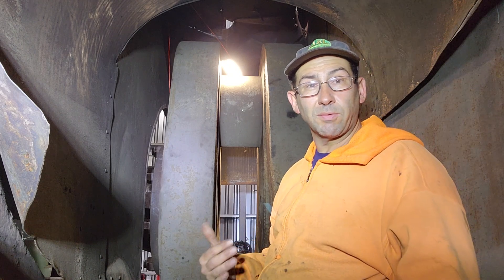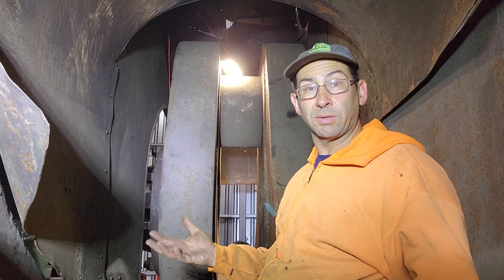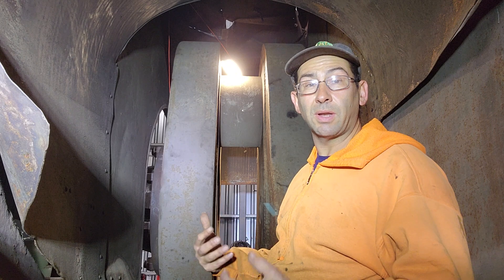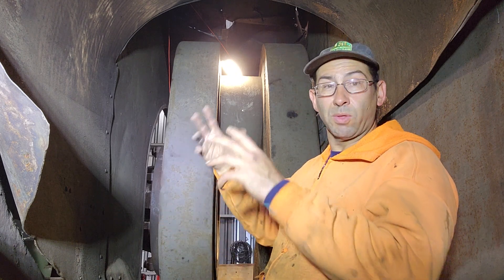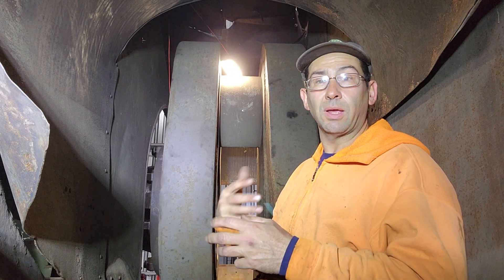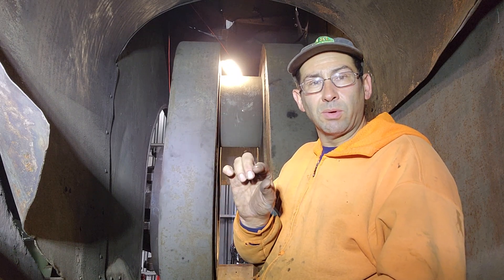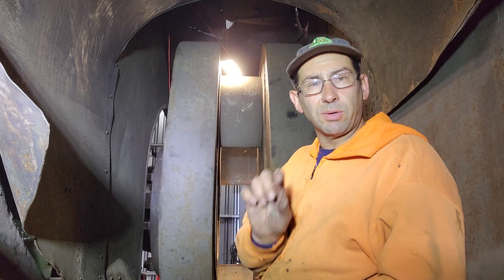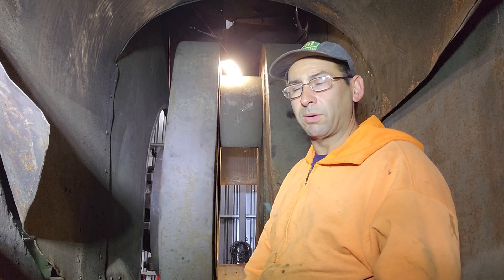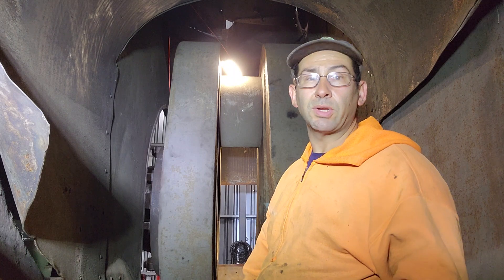So as part of the restoration of the engine, one of the things that we have to do is get this area cleaned up on both sides. Especially on the high pressure side, that connecting rod — the big end, where all the babbit is — all that babbit needs to be melted out and replaced, and then machined and put back in. Because there's a lot of cracking and crazing in the babbit. So instead of it being one piece, it's a bunch of little pieces and there's some chunks missing. If we were to use that, it would cause all sorts of problems on the crank pin. So at some point, that's all going to be melted out, re-poured, machined, and then installed.